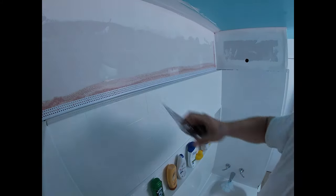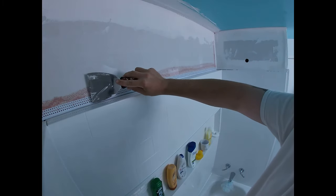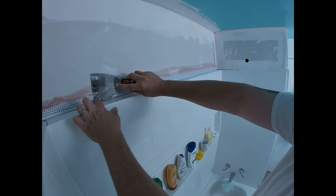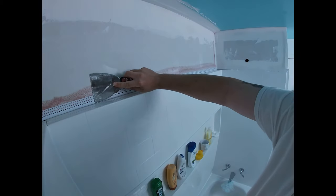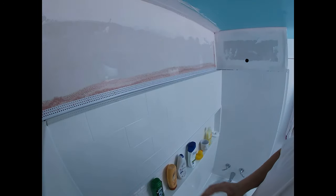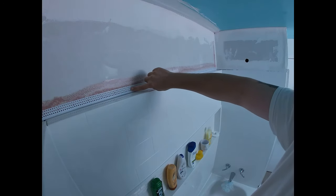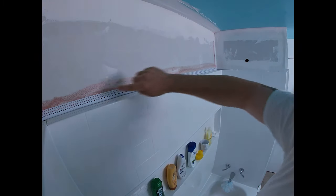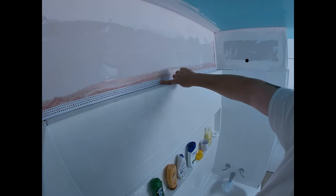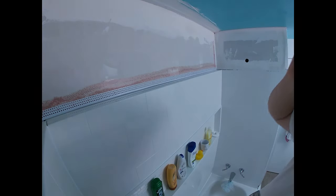When you're doing the mudding and smoothing it out, on this tear-away side you want to apply light pressure, and on the side against the drywall you want to put heavy pressure — that way it smooths out nicely. Also, there are holes in the bead, and even when the first one looked perfect and I thought it would be a one-coat job, the compound actually sunk into the holes when it dried. So you may need a second coat, which is no big deal.